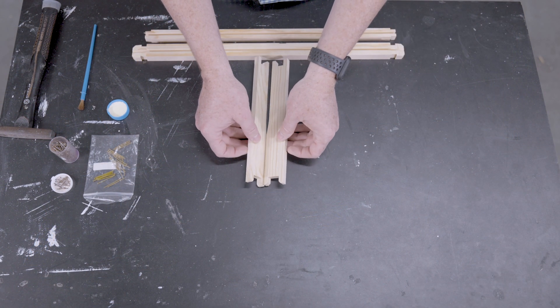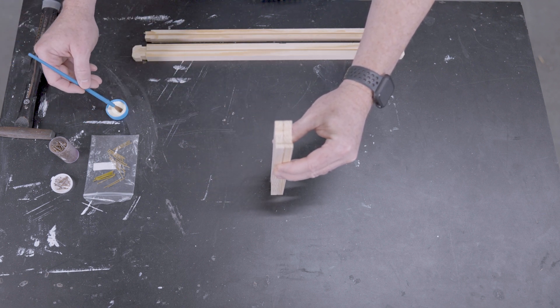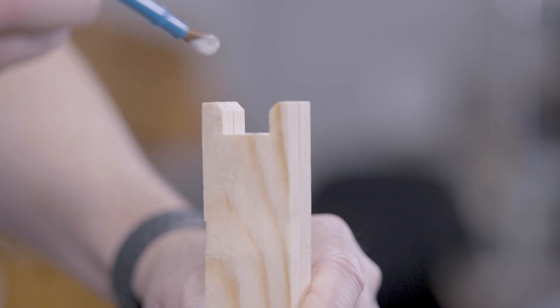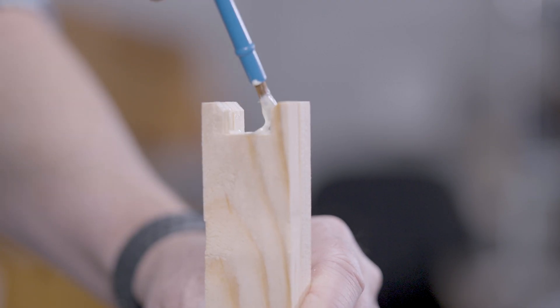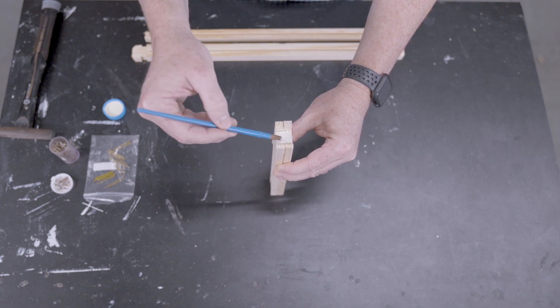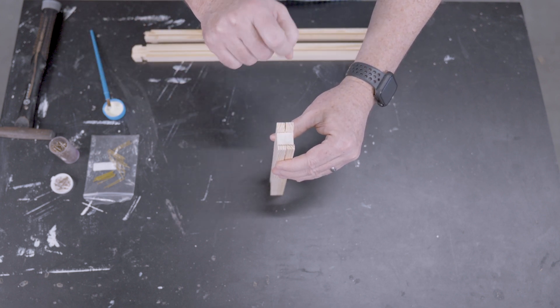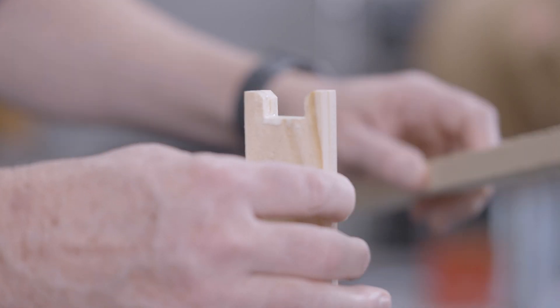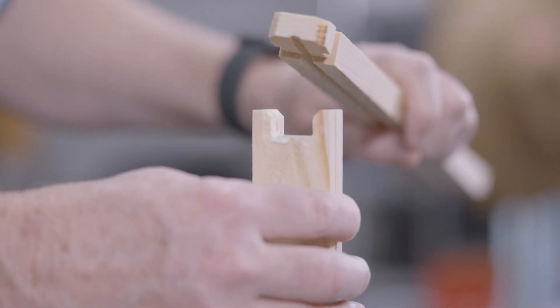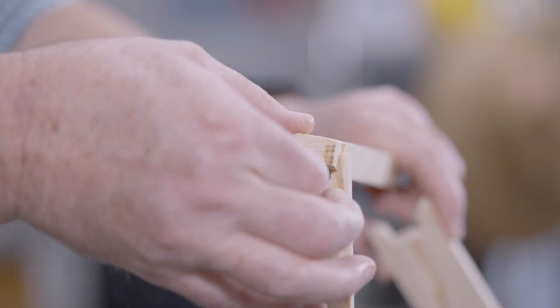In the first step, I grab the two end bars or side bars, stand them up, and use a small paint brush to put wood glue on the tops in the cut of the side bar. Wood glue is very important for the structural integrity of the frame — when you're pulling it out of the hive using your hive tool, you don't want the frame to come apart. Now that you have the top groove painted with wood glue, take the top bar and put it groove side down over the notch cut to accommodate the end bar. I'll repeat that step on the other end of the top bar.